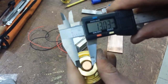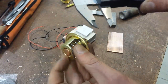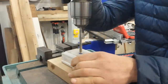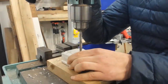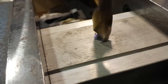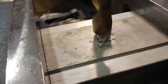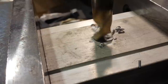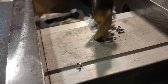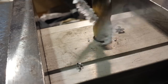We're going to want about a 13mm hole for that plunger. While I get on with that let me explain what is going on here. So we're drilling the hot side riser block. Its job is to transmit heat from the top of the stove to the TEG unit. If none of that made any sense to you, go check out my previous video all about stovetop fans, or follow the link in the description that goes to an instructable that explains right from the ground up all about them.